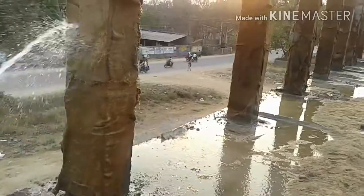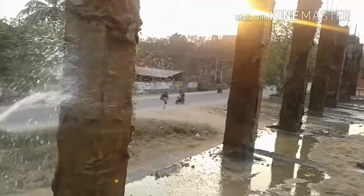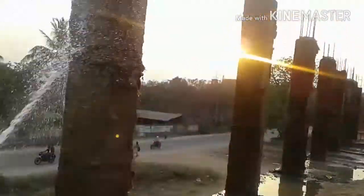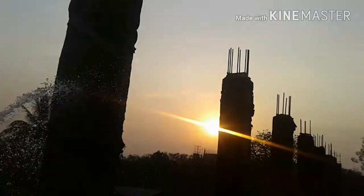Ponding is used to cure flat surfaces where water could be easily ponded. The best practice is to cure the concrete shortly after the chemical reaction has started, allowing the concrete to harden. Curing conditions will be maintained during the first 24 hours, or at least until the final setting time of cement has passed.